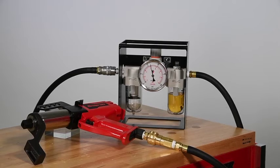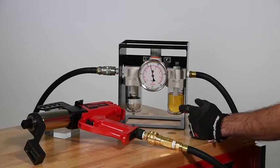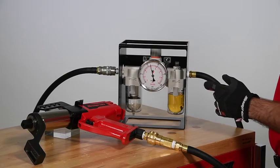Let's run through a quick demonstration of how to operate the PTM. An FRL filter regulator lubricator is required to operate these tools. Start by making sure your FRL has oil. Connect the air supply to the inlet side of the FRL and connect the PTM to the outlet side as shown.